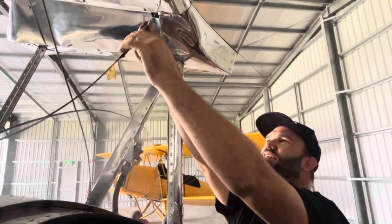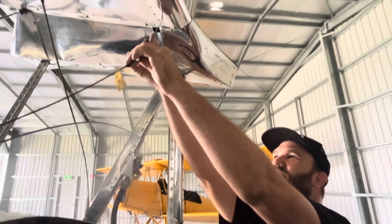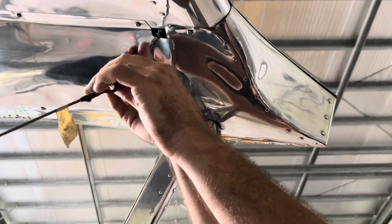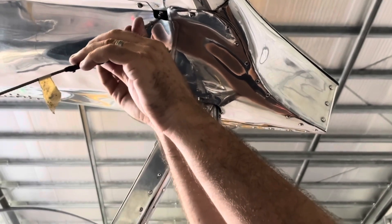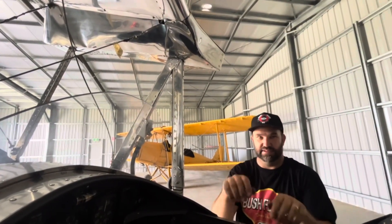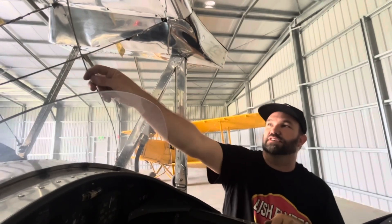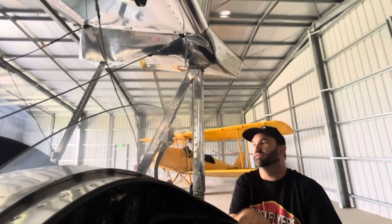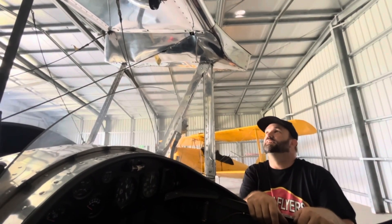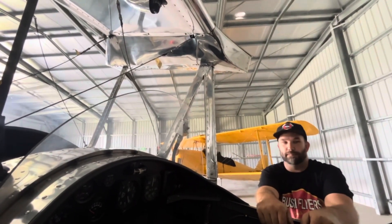Because this is the... Like that, see? Yeah. Then you can tension it, which I need to do still. That's why I didn't lock them off before. Does that require special tooling to bring down next time? I'll have to see if I can get a tensiometer just to get the same tension on each cable. And then we can lock it off. It won't be a high tension — it'll be like 45 pounds or something. Do you know somebody who has one? I do. Okay, great. So that's that. Then I'll lock wire those two together so they don't rattle loose. And that's that. Awesome. Thank you.